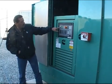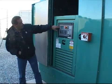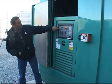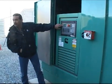If I want to look at alternator or AC output information, I go to alternator and that's where I'm going to get my line voltage, line-to-line, line-to-neutral, amperage, frequency, kilowatts — stuff like that.